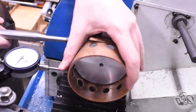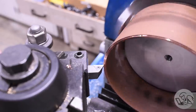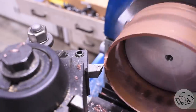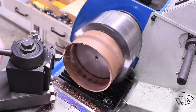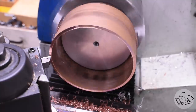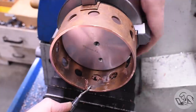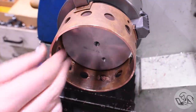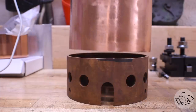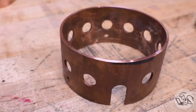I'm dialing this in just to balance it, but we're just facing the edge, so it doesn't actually matter if it's perfectly dialed in. I'm also using a different cutter here — this is an insert tool for aluminum. It's got a top rake designed for aluminum, but I'm actually finding it works super well on copper. The books say that the proper top rake for copper is actually the same as steel, but I am finding this aluminum tool works really, really well. You can see the beautiful finish that it's leaving there. It pushes over much less of a burr than the steel profile tools I've been using previously. A little bit of drama there, but we got it done in the end, as is the Blondie Hacks way. That edge came out great, and you can see that the roundness is really perfect now. You'd never know that it was very recently completely pear-shaped.